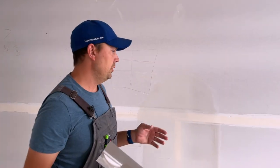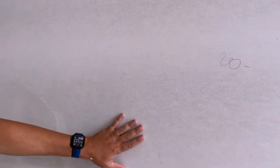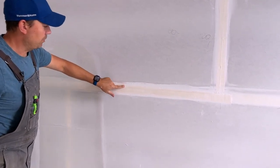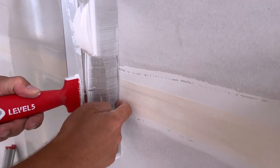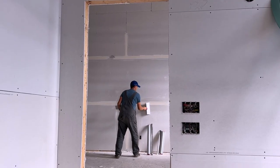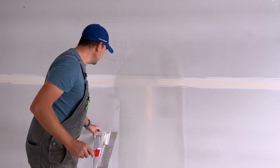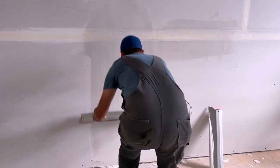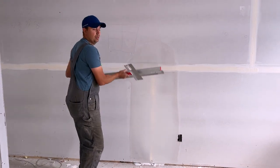So what a butt joint is, is where you've got two ends of drywall meeting together — they don't have a tapered joint on them. This sheet is laid horizontally and we have a taper right in it. When you put the two tapers together that's where you put your tape. And if you hold your trowel up you can see the light right in behind there — that's the void we're going to fill. Tapered joints are a lot easier to fill than butt joints. Butt joints you need to expand that line about two feet, otherwise you end up with a real hump on the wall. That's why using something like this — a 32-inch blade — guarantees you're going to be wide enough so you don't have those weird humps.